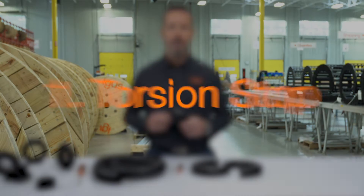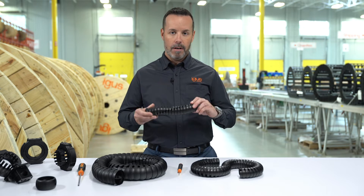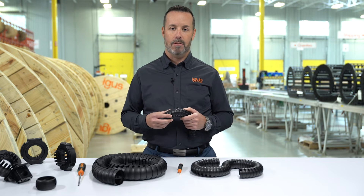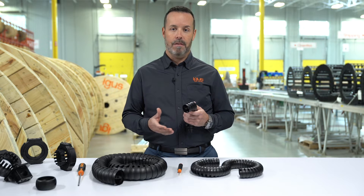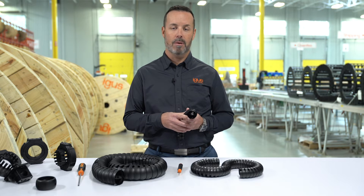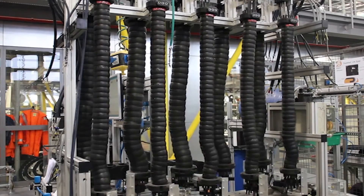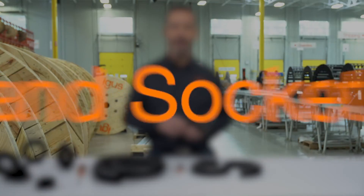The first feature is a torsion stop. The torsion stop allows TriFlex to rotate 360 degrees over one meter of material. This is important because TriFlex shares the mechanical stress of torsion with the cables. If you're not using TriFlex, you're probably using a corrugated hose — a product that resists torsion, thereby transferring 100% of the mechanical stress to the cables. With TriFlex, we can reduce conductor failure and shielding breakage.